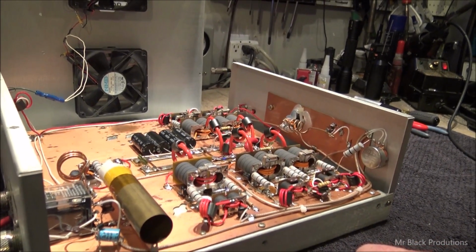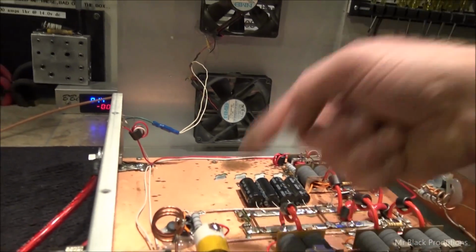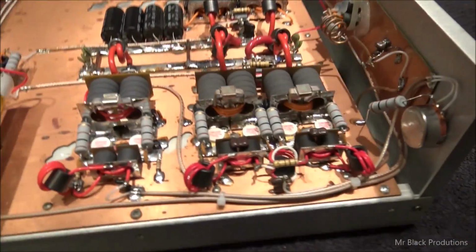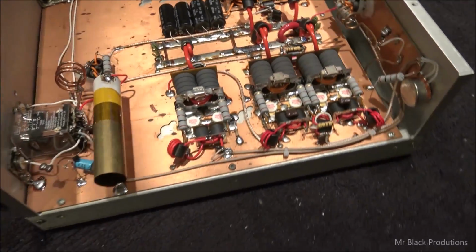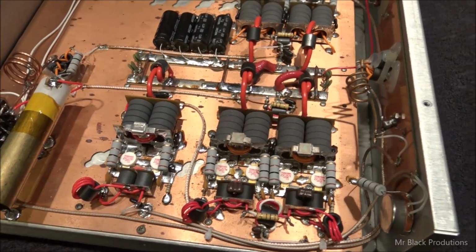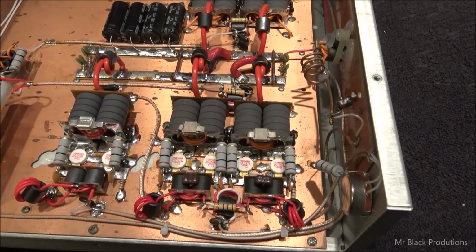Much more efficient. Replaced your burned input resistor. Redid the 5-watt output resistor, and then went ahead and did 5 watts all throughout the damn thing, because them little buffer resistors, believe it or not, get hot. Yeah, 2 watts are adequate. 5 watts works better. I don't care what anybody says, it works better. Measure it by any means: resistance, heat loads, operation, it works better. So therefore we use them.